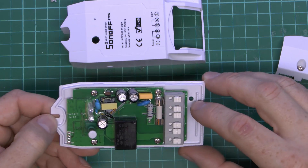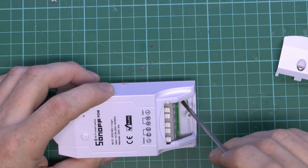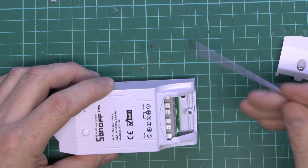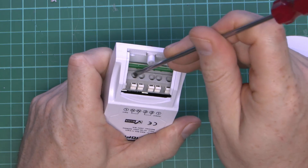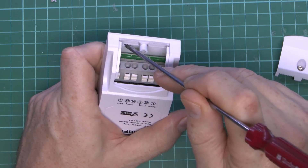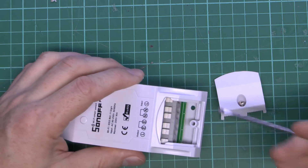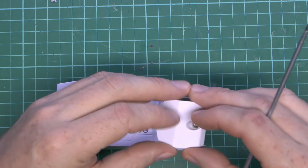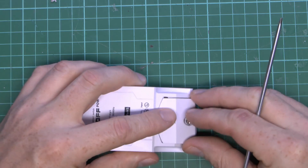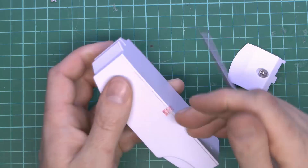In terms of safety, it's not a huge issue because this is the 5-volt side, so there are no mains parts inside here — obviously better if it wasn't there, but its reason is something we can't identify from this example. It's got a mounting slot here, and presumably this one is for another mounting screw. That's actually where the line and neutral are, so it's directly below the line and neutral cables for the input. The cable clamp does actually have these striated bits here — it is flat, so it would suggest a flat type of flex or cable would be more appropriate rather than a round one. That just screws in, no problem whatsoever. And it's reasonably well fixed together — it is only a clipped-together case, but it requires a decent amount of effort to get in there; you can't really get in there with your fingers, so a screwdriver is almost certainly required.